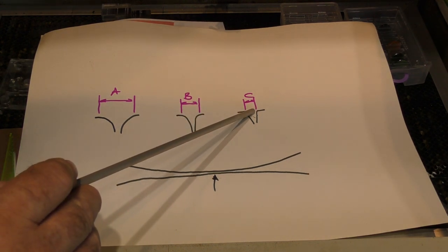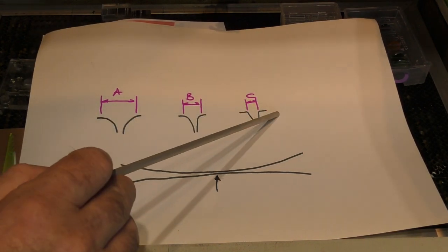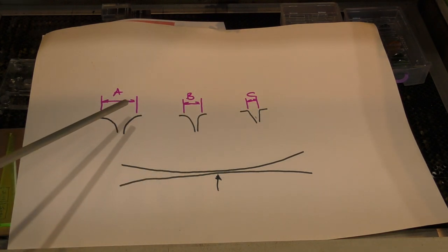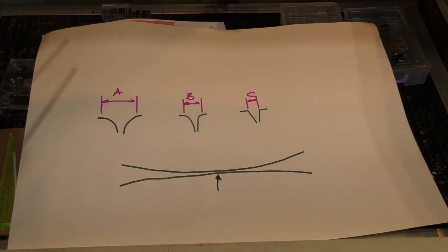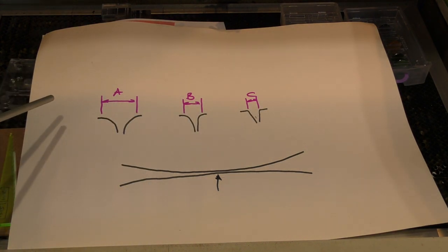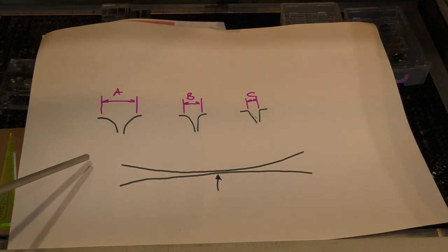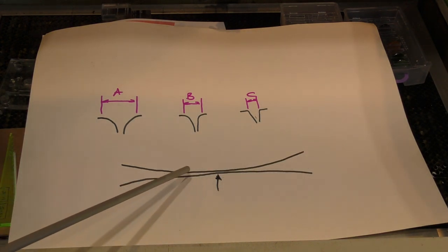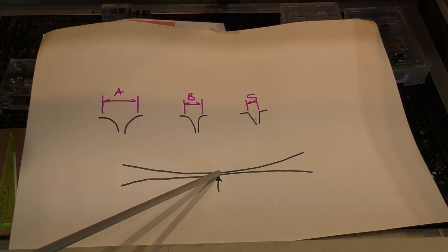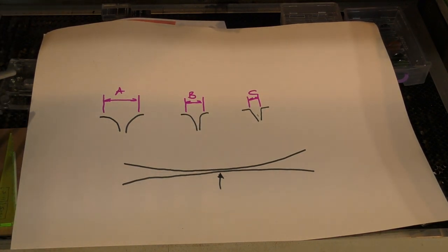And then as we move beyond this focal point, we effectively replicate these on the other side of the focal point. So we know that at that point there, we've got the correct intensity focus. That's using my line method of checking for intensity. Some people use the ramp test. They run the beam up a ramp and they look for this pattern here, the thinnest point being, hopefully, the same as that.